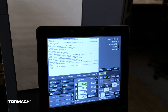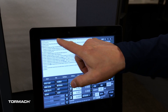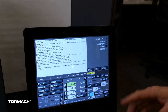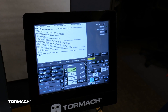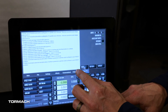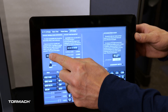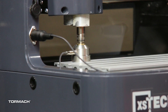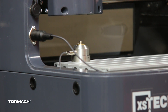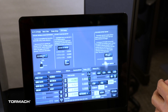I'm going to go ahead and hit ETS. Now this is a great example — when I hit that I get an error message just telling me I need to establish that we're on tool 11, and we need to let it know there is no tool in there, so we're going to put tool 0. Now that we're at tool 0 we can go back to our probe page and hit ETS spindle reference — we're referencing the spindle. It touched down and now we can see that green light is on. We've referenced the spindle.